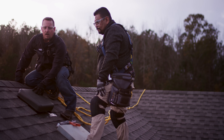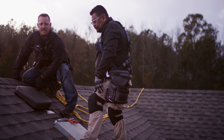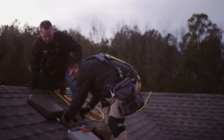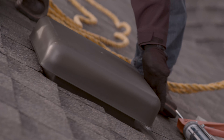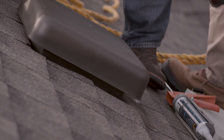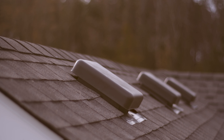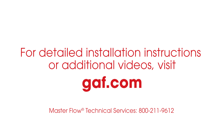The Masterflow RT65 has preset nail holes in the base flashing — nail those in everywhere you see those. Now the only thing we have left on this installation is to seal up our exposed nail holes with a matching silicone product or even a clear product and you're good to go. For other Masterflow product installations, check us out at GAF.com.